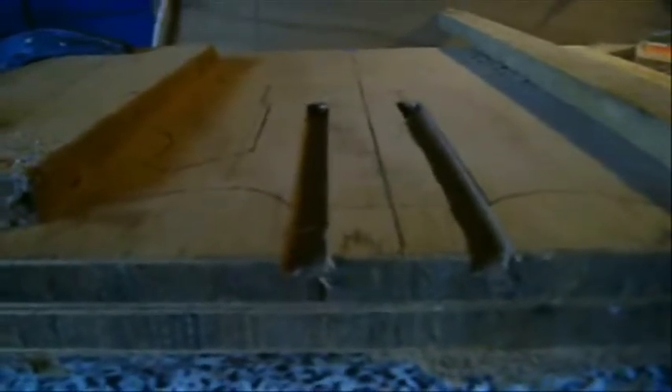After the first sweep, you can see how it looks. Straight down on the body, you can see they're nice and parallel with each other. What I have to do now is cut it a little bit deeper. I'm going to cut down to around about here — I've gone down around about 5mm — so just keep doing that run after run, and hopefully you'll get there. You'll see it's a nice clean cut, and then you just have to go across at the back either with a saw or a router as well.